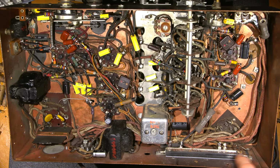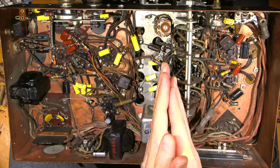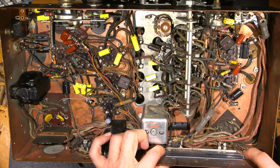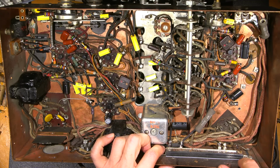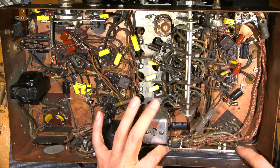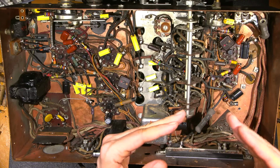You can see on the back side here, I've taken a piece of that, basically it's thermally conductive silicone. It's designed for putting semiconductors against heat sinks and transferring the heat to the heat sink. So it's resistive, and I've also put that underneath here. What happens is, over time, this plastic body of this resistor, or the compound that they're using at any rate, shrinks up a little bit, and the bracket gets loose. So by putting this underneath here, it acts as almost like a cushion, and in the tight spots, it's very tight, and it can expand into the areas that aren't so incredibly tight.